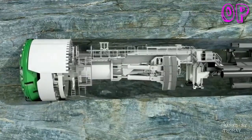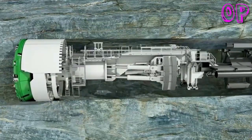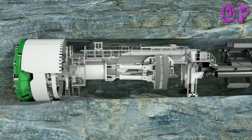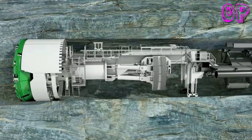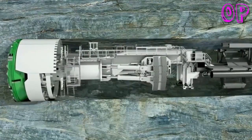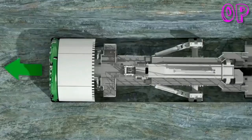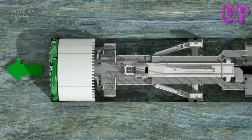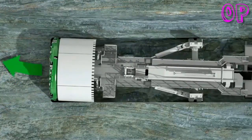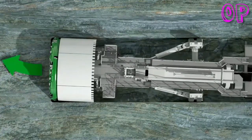A roof shield, often equipped with a finger shield extending backwards, protects man and machine against rock fall. The weight of the tunnel boring machine rests on the invert shield, which slips directly over the tunnel floor and serves as a pivot point for steering. After completion of a stroke, tunneling is interrupted. The machine support is extended and the gripper unit is moved forward toward the tunnel face. The gripper unit not only provides pressure for the thrust — it also serves to steer the TBM. The view from above shows the main beam on a sliding bearing in the center of the machine.